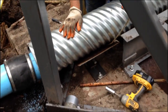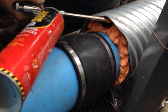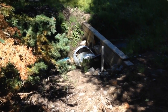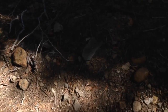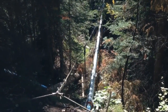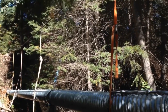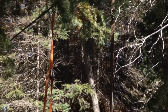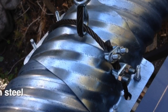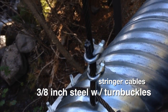The cradle is positioned under the culvert, and we installed some foam insulation at the ends to prevent rodents and to provide a minimal insulation space around the pipe. The pipeline is now complete from the weir intake across the 125-foot cable bridge. The ratchet straps used during construction will be replaced with steel cable and hardware, with turnbuckles on each of the vertical stringers to adjust the level once it is filled with water.